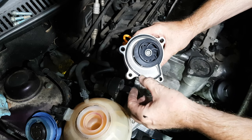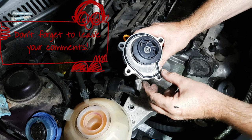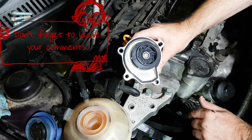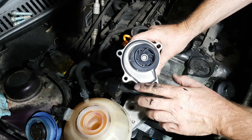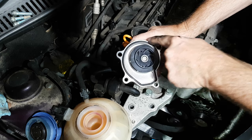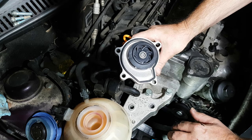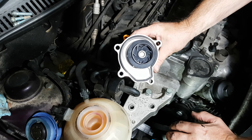When you place it in that groove you might find that it keeps springing out. A little trick I used is to place the o-ring in some very hot water — right up to boiling if you want. Leave it for five minutes to get nice and warm and soften up a little bit, then place it into the groove fairly quickly and allow it to cool, and it'll stay there just like you see here.